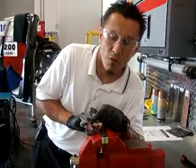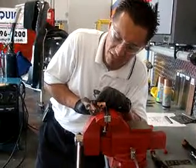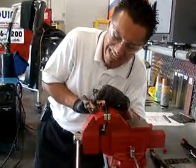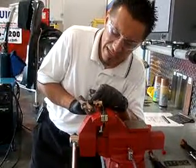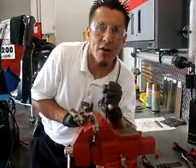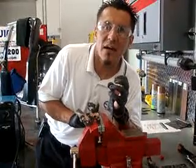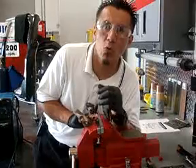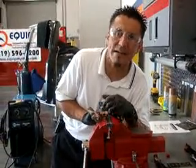The Cobre performed just incredibly well. You can see where it flashed and actually shrinks right back down into the nugget, as it did with the squeeze time resistance test, and creates a really good corrosion protection gasket. It creates a very highly conductive electricity path for the welding to take place and keeps that weld super cool during the actual welding time.